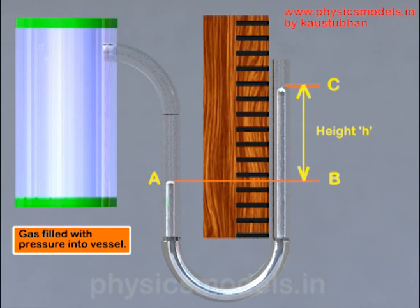The gas pressure is what we need to find out in this manometer. The simpler way to find it is to calculate the pressure at point B, which equals the pressure due to the height of mercury above B — that is, from B to C — plus the atmospheric pressure acting on top of the mercury at point C.